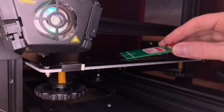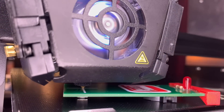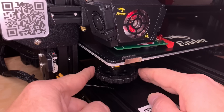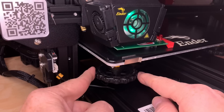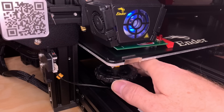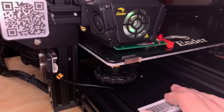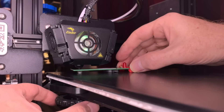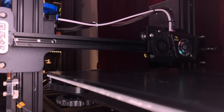The printer will move the nozzle to each of the four corners and stay at each one for 20 seconds. At each corner, put the crosshair mark of the e-leveler directly under the nozzle. Turning the bed adjustment knob clockwise brings the bed closer to the nozzle, and turning the knob counterclockwise moves the bed further away from the nozzle. Adjust the knob until the LED just turns on. If the LED is already on when you put the e-leveler under the nozzle, adjust the knob to turn it off and then adjust again until the LED just turns on. After 20 seconds, the nozzle will move to the next corner and you'll perform the same adjustment there.